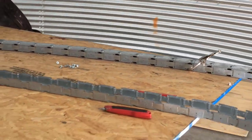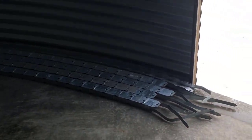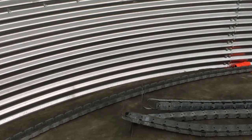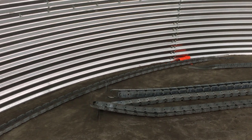So he's making the bottom track and the top track, getting them all ready. These will all be screwed down into the floor — the concrete. So this is where we're at. All the tracking has to be in place, and then the framing starts for floor one.